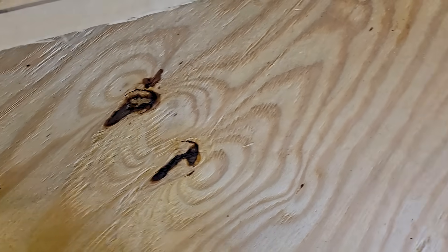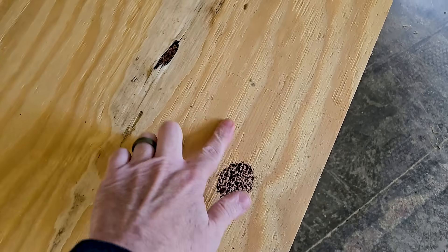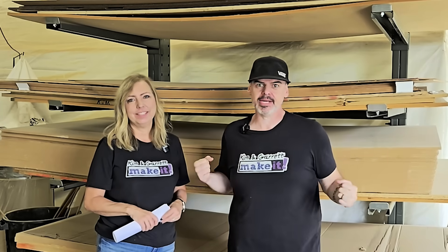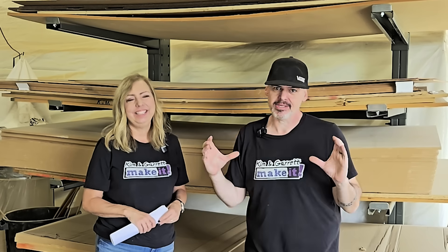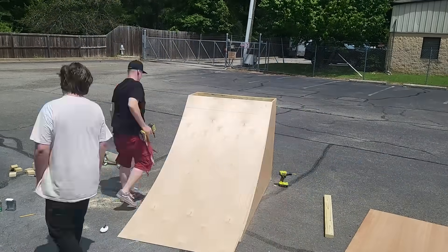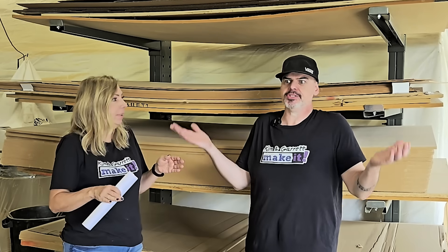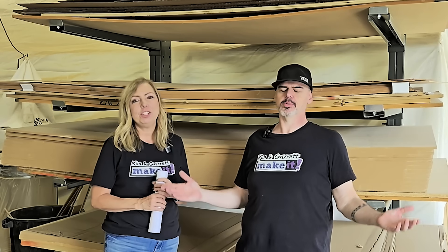However, we said half-inch plywood, and that hardware store gave us the cheapest half-inch plywood they had. It was so warpy, full of glue pockets, center pieces missing — it was horrible. When we unbanded it, that stuff tried to taco immediately, like a half pipe right away. Every sheet we pulled off did the same thing. We knew right then this was going to be an issue. We let it sit on the ground for two days and tried to cut it down to the size pieces we needed so it would be less warpy.